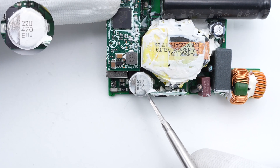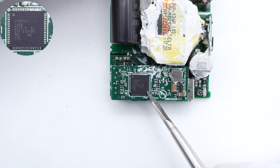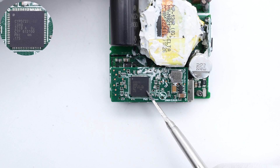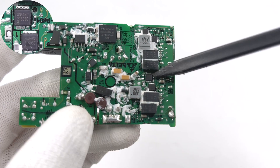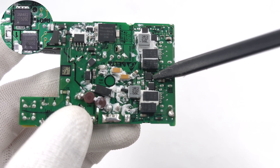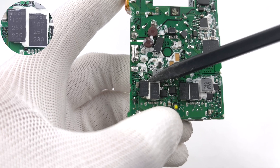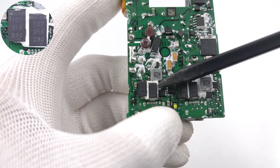The solid output capacitor is 25V, 470μF. The protocol chip is soldered on a separate small output PCB from Infineon's CCG7DC series, which also integrates two buck-boost controllers designed for multi-port chargers. There is a 3.3μH alloy inductor for buck output. The two synchronous buck MOSFETs are from Advanced Power, PMPAK 3×3 package, 30V, 4.2mΩ. The two SMD solid capacitors for output filtering are from KEMET, 100μF, 25V.